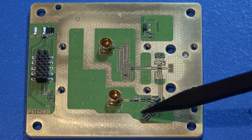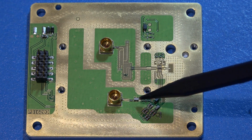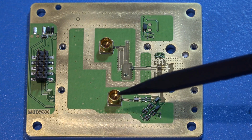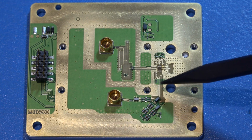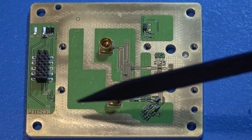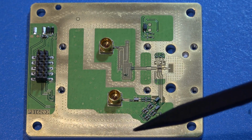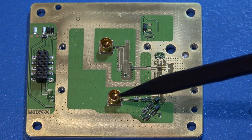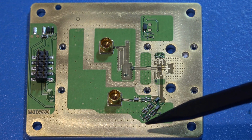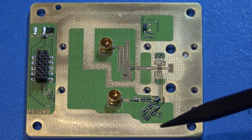Now, they're doing 2 things with it. They're taking one of them and they're tapping on the side, and they're going single-ended through this balun, and they come out of this, which means this is a higher frequency output. And then on the other side, the other 4 terminals just get buried deep into the board, and they come out on this side, which means that they're capturing one side of the down converter at a high frequency and the other side at a low frequency. So they're doing something interesting and unusual with those 2.